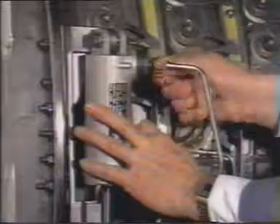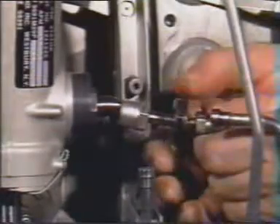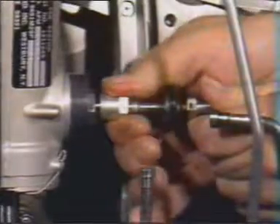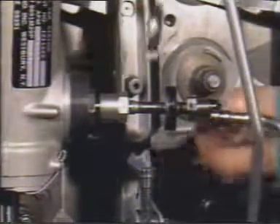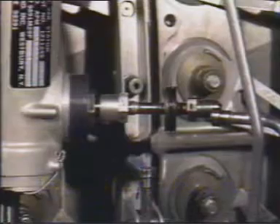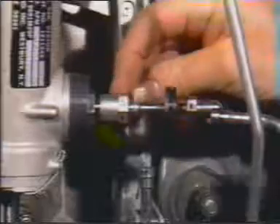The small plastic hose may now be removed from the port unions. The O-ring on the rod end oil tube should be replaced with a new lubricated one. Connect the rod end oil tube to the rod end union and torque the coupling to 135 to 150 inch-pounds. Safety wire the coupling nut to the port union.